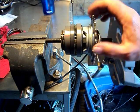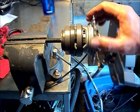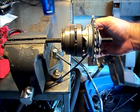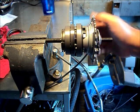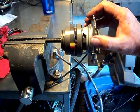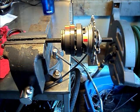Seventh gear: stage one and three are engaged to the axle. Third stage outruns the axle, the center two marks stay together, final drive outruns stage three, stage two outruns the input. Final drive ratio one to two point five. Eighth gear: all three stage sun gears are engaged to the axle, so each stage will outrun the one before it. Final drive ratio one to three point two five. Watching carefully as I rotate the input one revolution, you'll see the output revolve once, twice, three times — about three and a quarter output revolutions for one input revolution.